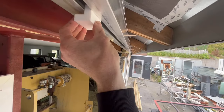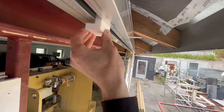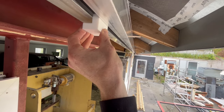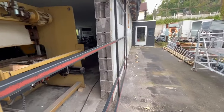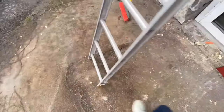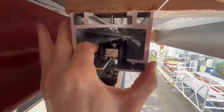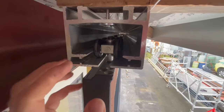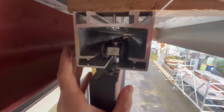This is going to be like this now. That's going to be the clearance, and this is going to stop it from going more than this left and right. We managed to put on the white spacers, the nylon crosses, yesterday. But look now, it's still not perfect. It's sliding not too bad, but it's not 100. The reason, I think, is that the side of those wheels can move like this, because normally those wheels should be up here and not have too much space sideways, so it goes straight.